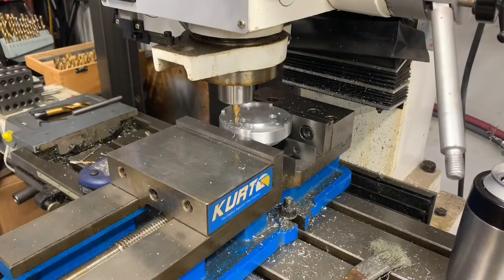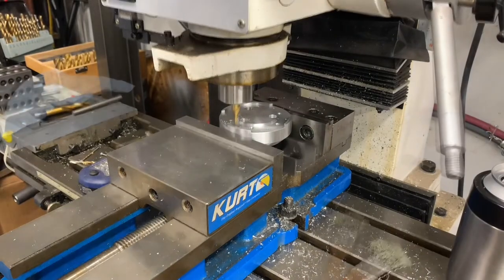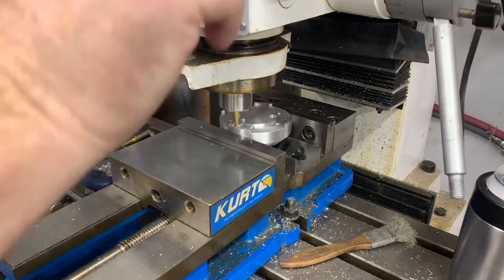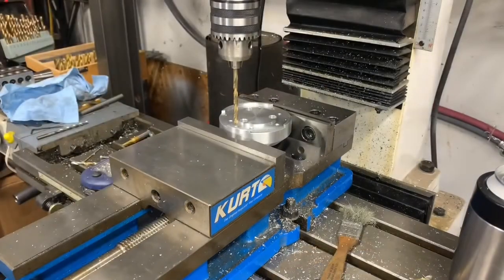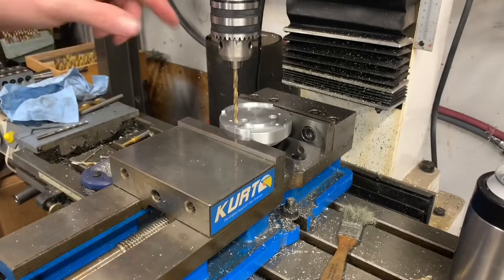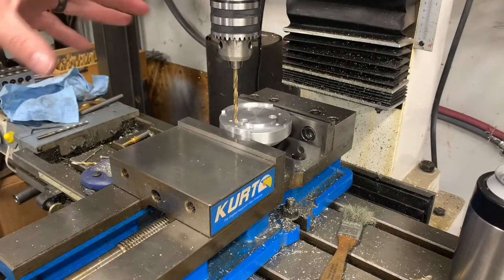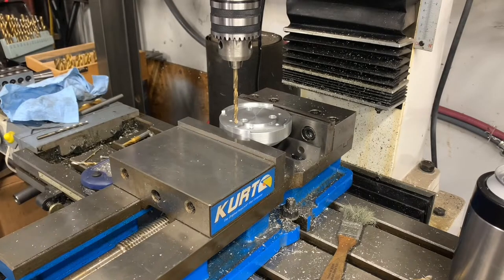Seems like there might still be a little bit of tap down in that hole. All right, so after several iterations between the 3/16 end mill and taking the part out of the vise, taking it back over to the bench, trying to beat out that tap with the punch, I was able to take a cobalt bit, sharpen it in my sharpener, get it really sharp, and kind of peck away just gradually at the rest of it.